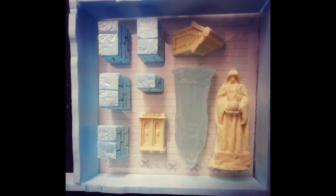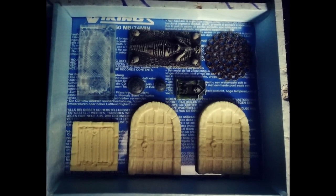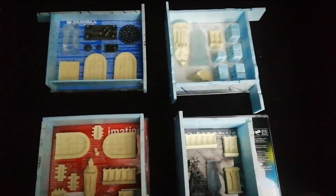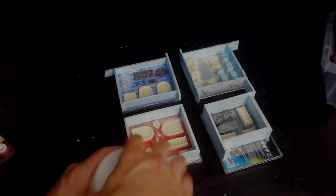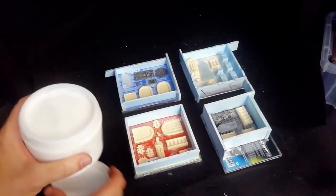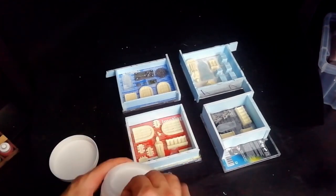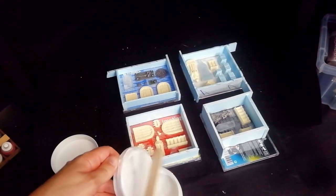Another important detail is the shape of the frame, which, as you can see, here I am creating with pieces of XPS foam expertly cut with my Proxxon. Lego are fine too, of course. A regular shape helps to seal everything well and to more easily avoid silicone liquid leaks, as well as favoring, once ready, the storage of the molds. Always check that your frame is higher than the pieces included inside the mold.